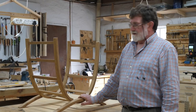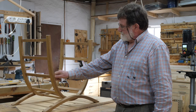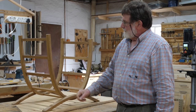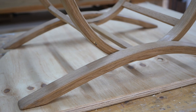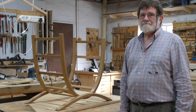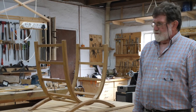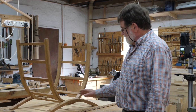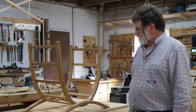This piece is made of oak, which is fairly hard and brittle in comparison to some of the other timbers we've used. The laminations were quite thin, and the way I did it was to just try it — I broke a number of them and kept making it thinner until it bends nicely. Some woods are more brittle and harder, and when you've got knots in them they will crack at the knot. So the thickness of the laminations depends upon the type of wood and the curvature — a nice flat curvature is much easier than something with quite a small radius.